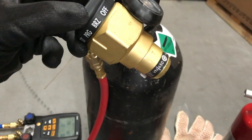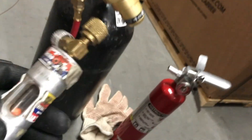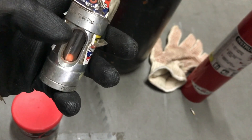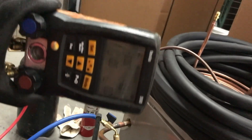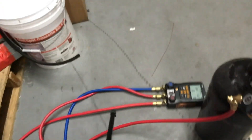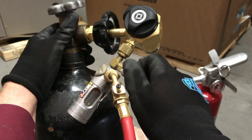I'm ready to braze now, so I'm going to turn it to braze. This actually slows down the flow — usually between two to five CFH, cubic feet per hour. You can use any type of regulator and then hook this on. You set it just barely floating and you're flowing nitrogen while you're brazing. The flow is really low — you can see in my gauge right there it's zero. My gauges don't even know this is happening. So get yourself a tool you can use all the time, something easy like this. Turn this back to purge so I get a little bit more pressure feeding in. The ball has flown up because I'm flowing too much air through right now — just tighten it down. There we have it — we have a floating ball. We're ready to start brazing.